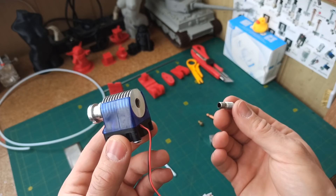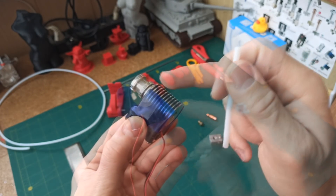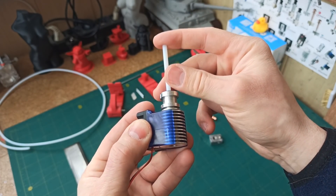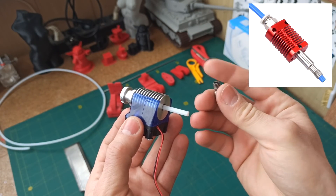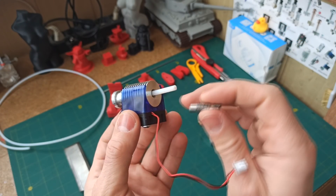So, friends, how do we correctly assemble our hot-end? As an example, let's take this E3DV6 from MellowStorm. Pay attention to the radiator design — it is completely through, meaning the 4mm teflon tube passes all the way through, just like the MK8. But the MK8 uses a smooth thermobarrier, while ours has a threaded one, because the radiator has a threaded bore.